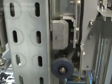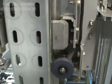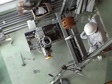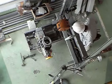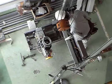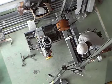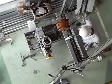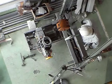Use a steel plate of 5 mm in thickness to adjust the clearance between the guide rail and the clamp. When fastening the safety gear to the guide rails, align the fastening position to make the safety gear completely horizontal.